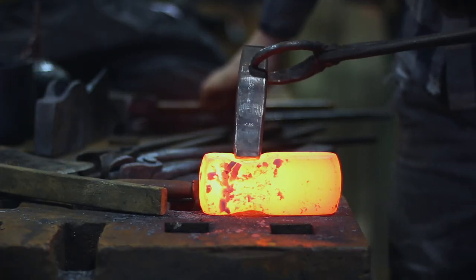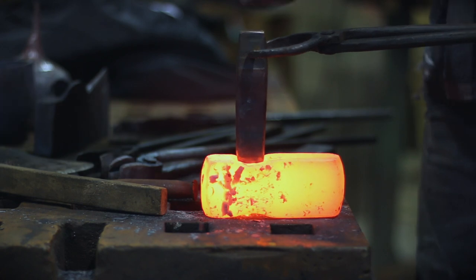I do my drifting a little differently than most people. I know I want to be finished with the classic teardrop axe shape — I love it, it makes sense, that's what we need. But to make that drift is expensive just because it's a lot of work, and drifts are consumables because the hammering of the cheeks compresses it under the hammer and wears out the drift. So I do my first series of drifting with basically a rectangular drift with rounded edges — this drift is super quick to make under the power hammer, no special grinding.